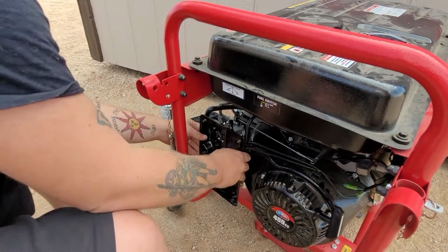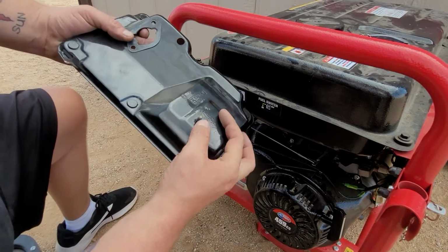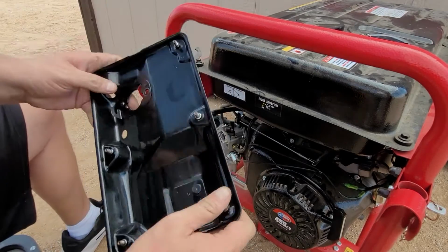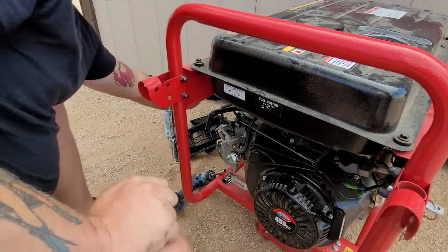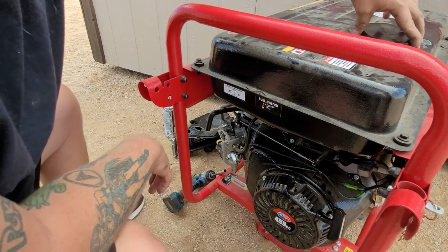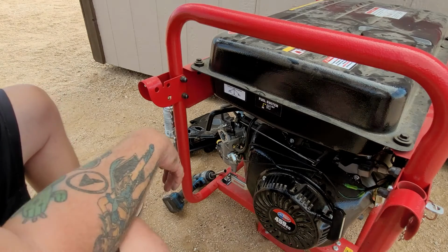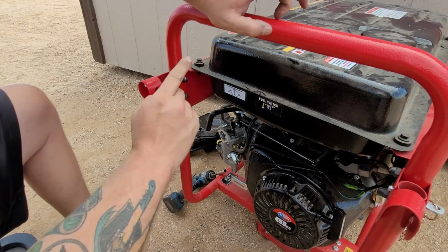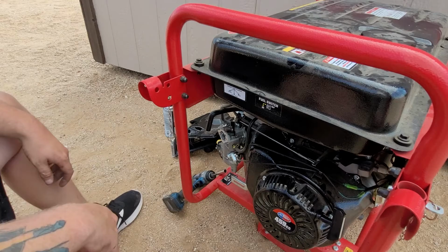So, we magically were able to get our thing back there, so now we can get this off. You see right there? They could have put it reverse, made it easier. So, that's 1 part, 2 part, 3 part. 3-part air filter assembly on 90% of your generators. And then put this gas cap back on because the customer wants me to leave it running because they're going out and they just want to be able to charge their batteries, because they use this to charge their batteries in the sun. But it's been overcast recently, so they need this up and running quick.